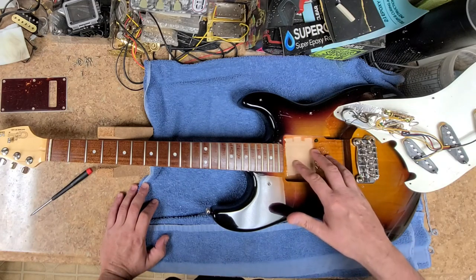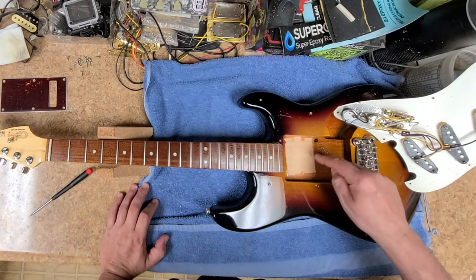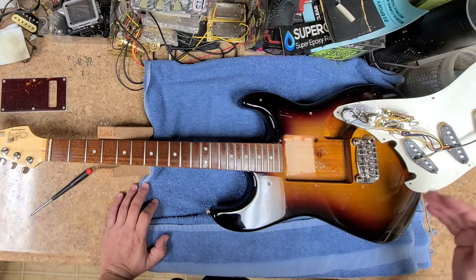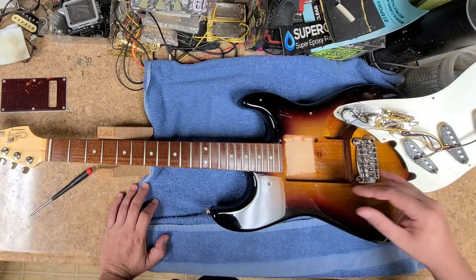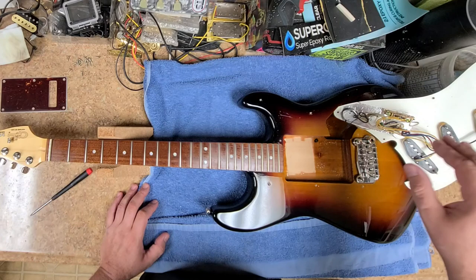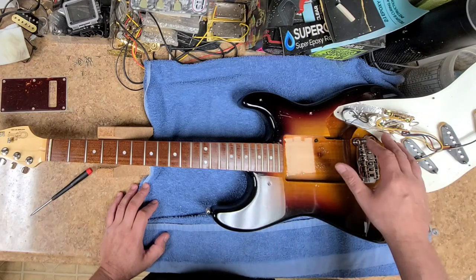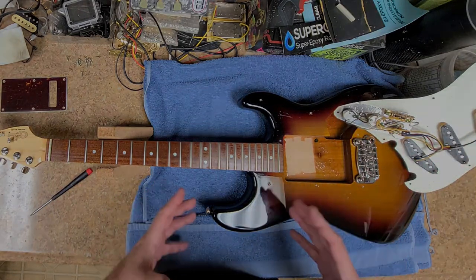So this is going to be an easy guitar to work on. I'm going to have to remove the pickguard, do some desoldering, and get this shielded because it needs it bad. Same thing with the actual pickguard too — I'll be removing the pickups from the pickguard and start shielding it. This part here is alright. The shielding tape that I have will connect with each other — from the sticky side to the metal surface will give me continuity, and should be fine as far as shielding everything and getting everything like a Faraday cage.